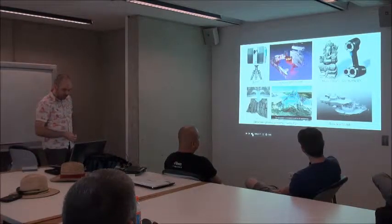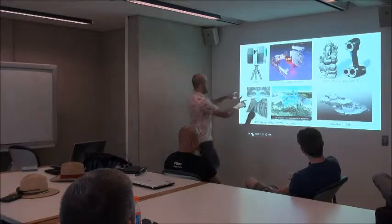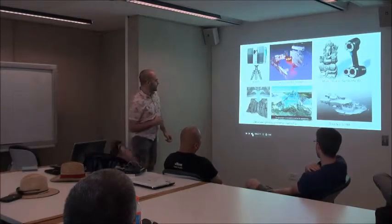A couple of other options. Quite popular these days is photogrammetry techniques. The bottom left and bottom middle are two examples of this. So basically, take two photos and do some clever maths comparing the two photos, and that gives you a three-dimensional image of a surface. Advantage is colour, high detail. Disadvantage, you're kind of limited to the geometry. An undulating surface is fine, but not trees and bushes and things. You also don't get scale from it. It doesn't have to just be two images, you can have n images, but you don't know your scale.